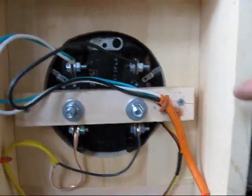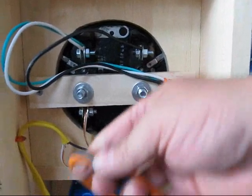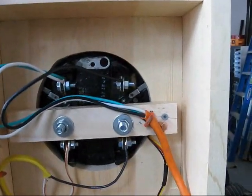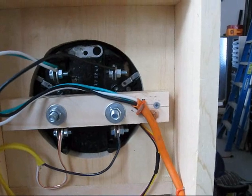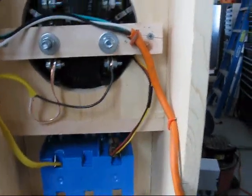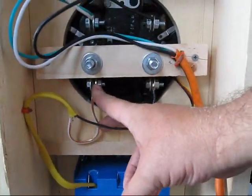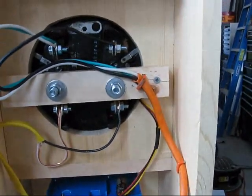I went ahead and wired the meter. The hot side is here, coming off of an extension cord — hot side over here, and common and ground over here. This is an old four-blade meter; a five-blade or six-blade meter would be wired differently. Also, to account for any shorts, on the load side the hot comes off here, and common and ground go into the same blade on this side — that way, if there's a short, it still registers on the meter.